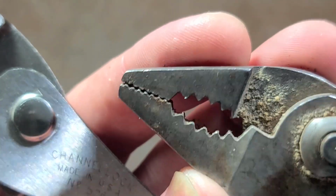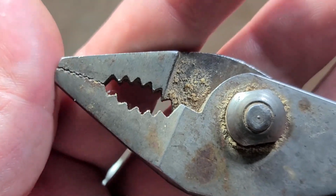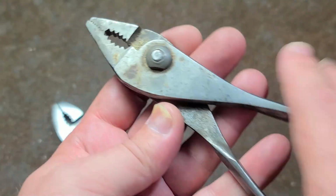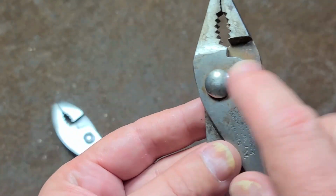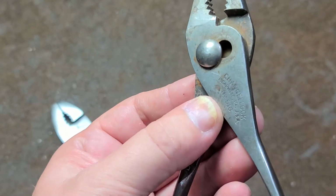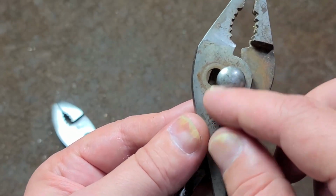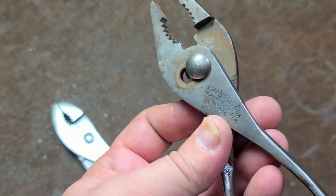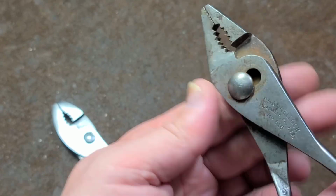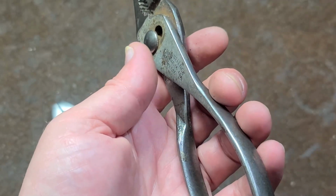Another thing I always kind of liked about Channel Locks as far as slip joint pliers, both the 526s and these old ones, is that their teeth happen to be exceptionally aggressive, just really deep, really sharp teeth. Pretty nice set. Another thing, pretty good precision here. On some slip joints, you just turn them a little bit and they'll slip, kind of indicating that the figure 8 pattern just isn't particularly well machined, but on these, you have to get them almost 90 degrees. What that indicates is that there's just a bit bigger of a nub right in the middle. Allows them to have a little bit more space. Or, excuse me, take a little bit more load when you're using them. It's not an issue when you're using them in the larger capacity, but the load is there when you're using them in the more normal and lower capacity, or smaller jaw position is what I should say.